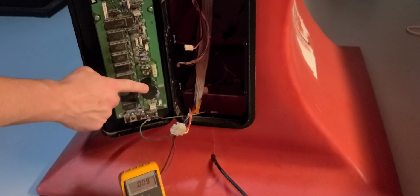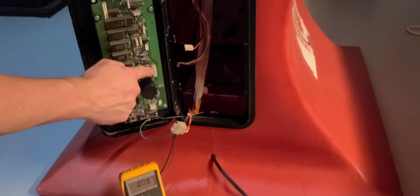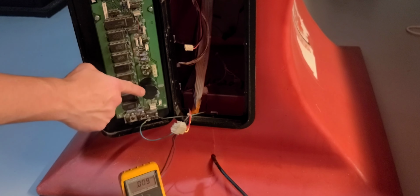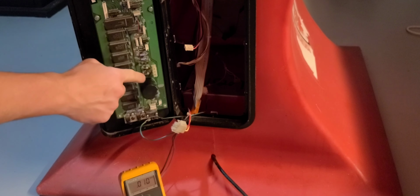If the machine happened to test bad on those readings, inside the power brick there is this capacitor, which is a snap-in type capacitor when you look them up, and then also 2 MR752s that will be inside there that will need to be replaced. If you're getting bad readings, it's more than likely this cap. When you open that up, you'll see a bulge in that cap, and that's probably why you're getting bad power. But I go ahead and replace the MR752s while you're in there as well, and that should fix the power brick if you're having any issues.